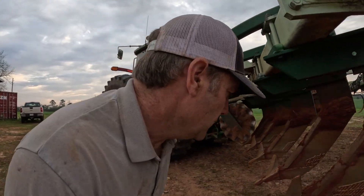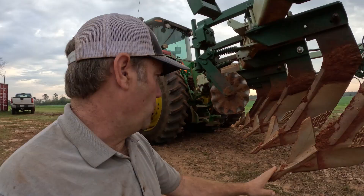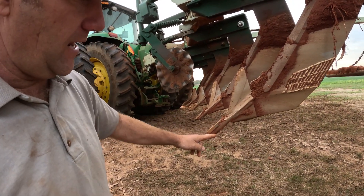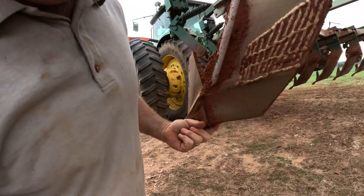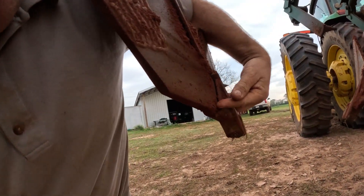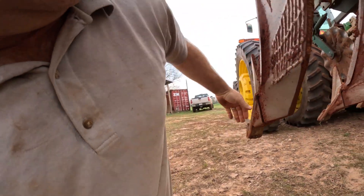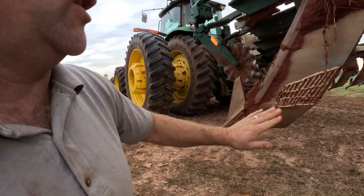We're going to switch back over to the bottom plow. I've got my tractor serviced up, so now I'm going to look over my subsoiler. What I'm looking at is the wear on the points - initially I'm going to look and see if they're hanging down, because as they get worn they won't be hanging down as far. Then I'm going to look at the back of them, as sometimes the back will wear thin. This one's not worn thin, it's in good shape.